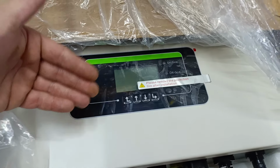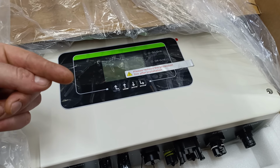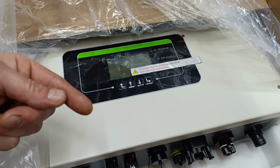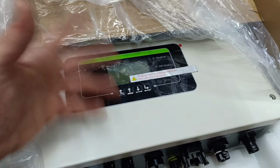The firmware on the Lux inverter is several versions out of date. It won't connect to a device to be able to do the software update, which is available. It says won't connect to a device, retry, retry, retry, and gets nowhere. But I can fiddle about with settings on my mobile phone, so it will connect to a device, but it won't do an update. The one time that I did manage to get it to connect to a device to do a firmware update, it just sat there and did nothing, and timed out. That was the end of last week. Since then, I've lost all hope of it.